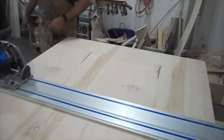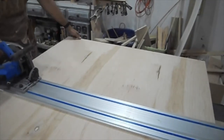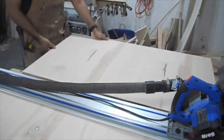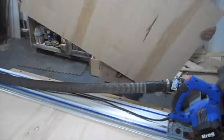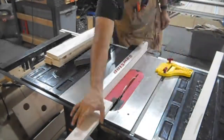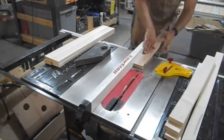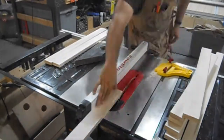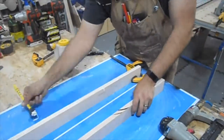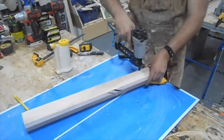Here I'm starting off by ripping down a sheet of three-quarter inch maple veneer plywood using my Kreg ACS system. These two sheets will be the floor of the crate and an interior wall. Next I move on to ripping down these three-quarter inch maple solid hardwood boards to create what will eventually be the side structure of the crate — these will be the four corner posts.